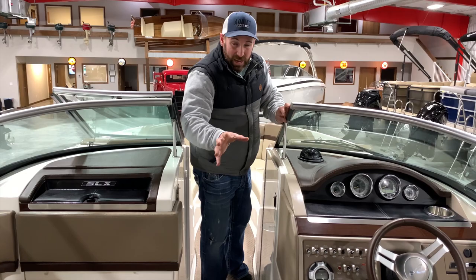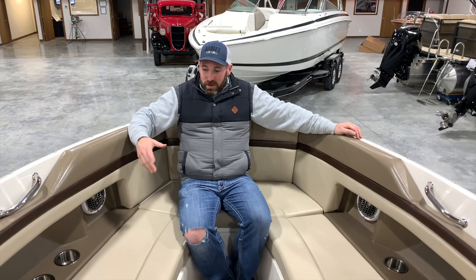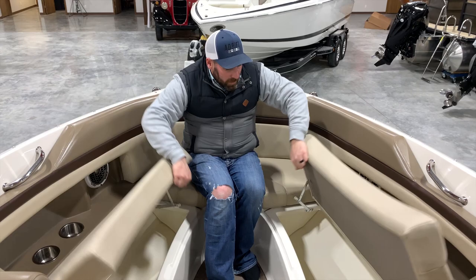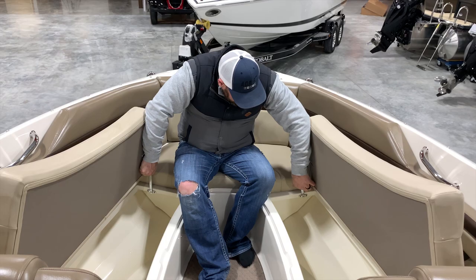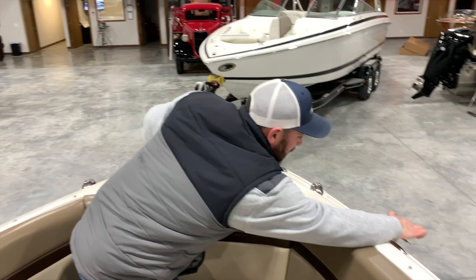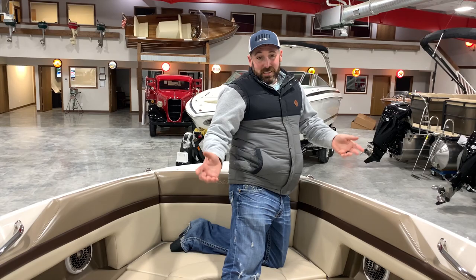Coming into the bow on the deck — keep in mind I'm sitting dead center in the bow, and look how deep I am. That's called freeboard. It has a lot of freeboard, which is interior depth. Usually kids want to run up here, get on their knees and look out, and on a lot of boats you worry about them falling because it's not very deep. Not this thing — very, very deep. You have grab handles, or as we like to call them, ocean handles. These flip up and have hinges to hold themselves up so you can get into your stuff without holding it. These just break away and fold down. There's an entry locker above the stem — you can put your anchor in here, there's more storage underneath, and the cleats pop in and out. This bad gal's got a 350 mag MerCruiser, 300 horsepower, trim tabs, Bravo 3, under 100 hours. I absolutely love this boat — it's in stunning condition. Please subscribe if you haven't, and I'll see you on the water.